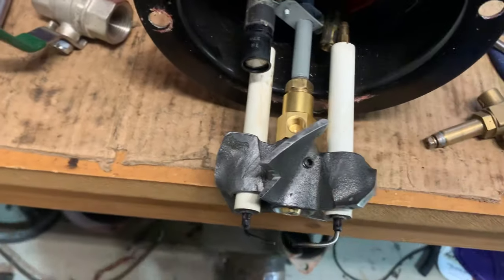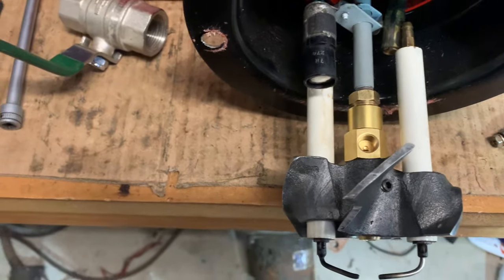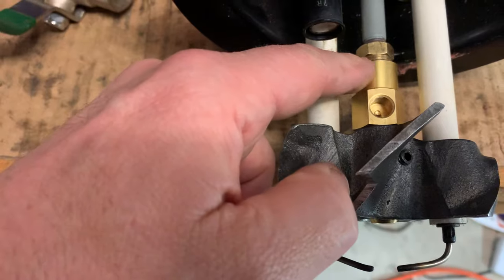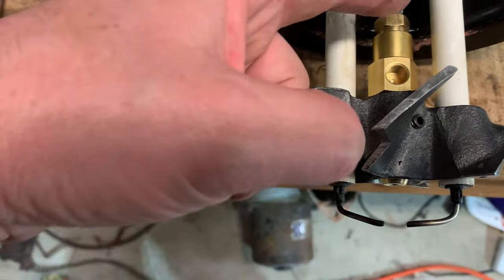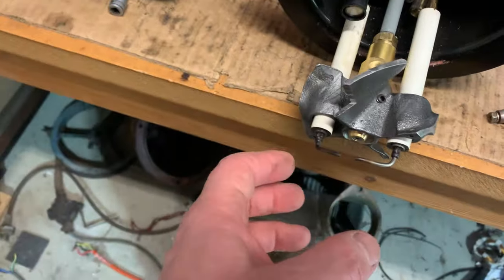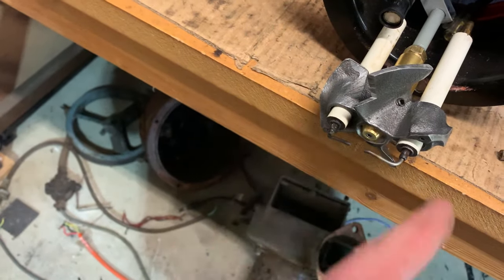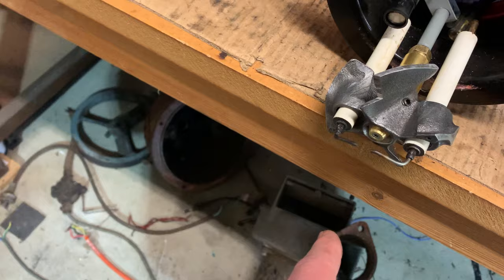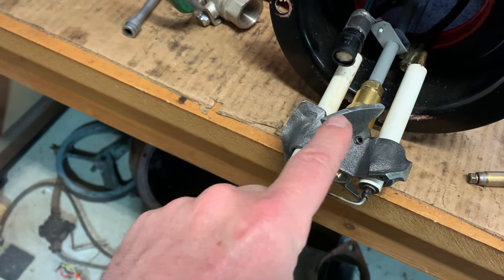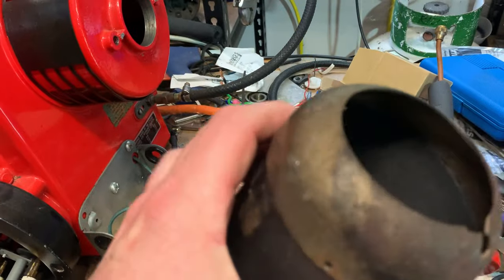When you're running a single nozzle it's always good to insulate as much as you can with your oil line. You could even apply a bit of insulation around the nozzle here to help keep the heat in, because as the air passes from the combustion blower you will get a bit of a cooling effect. These old burners used a slightly different method for turbulation of the air to get spin on it to help with atomization — instead of using a fine perforated disc, they used these larger setups.